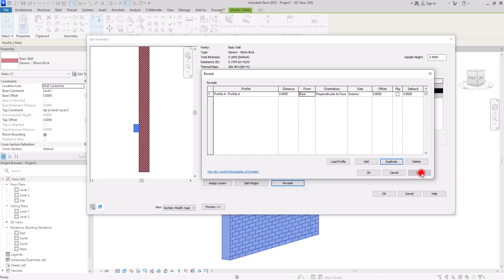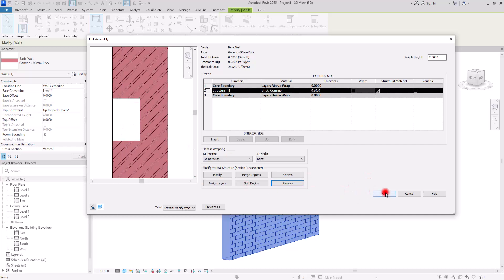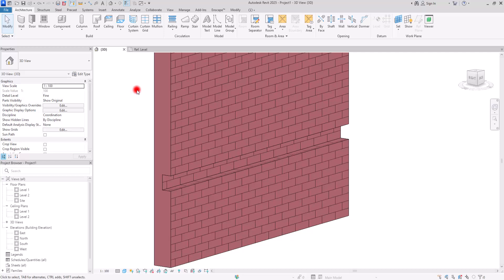It's in this part but it should be inside the wall. With the Offset setting I'm going to move it inside. The width of the handrail was 10 centimeters, so I'm going to set this offset to 10 centimeters too. If we apply, it will be exactly inside the wall. Click OK and now you can see it is empty in here.